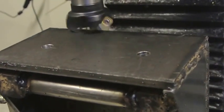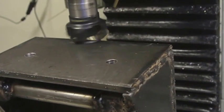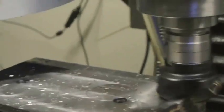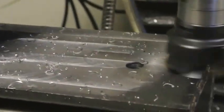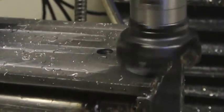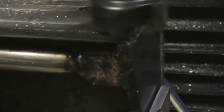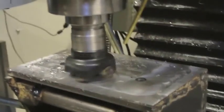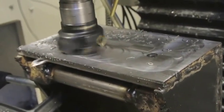We're just starting the first pass and you can hear it's just touching the metal here - it doesn't seem to be too bad in terms of being out of true. I can see from the cut over on the far corner that it's only going to take two passes of ten thou, which isn't bad for welding work, considering how the setup was for clamping everything together when I welded it. So it's going to take another one - there's a little bit in the corner here that's slightly off, but never mind. That's definitely the last pass. There's just a tiny bit that hasn't been coloured. I've got 30 thou taken off altogether - it isn't too bad.